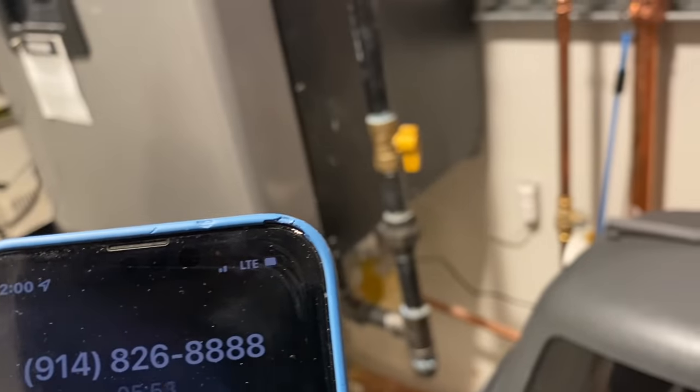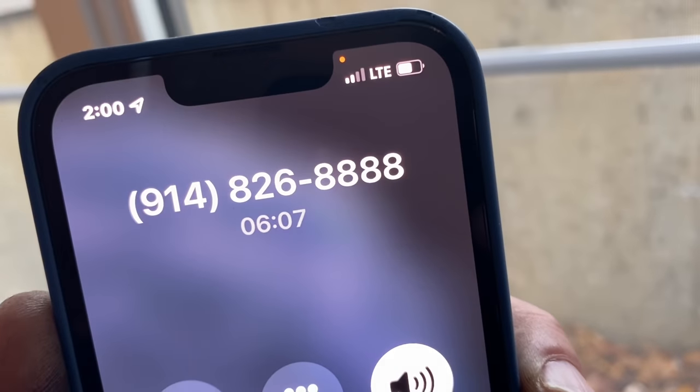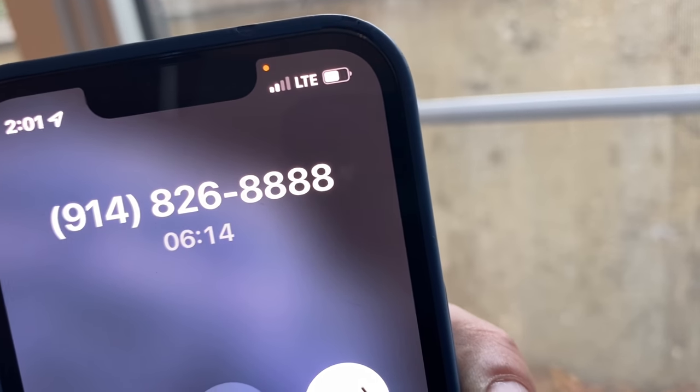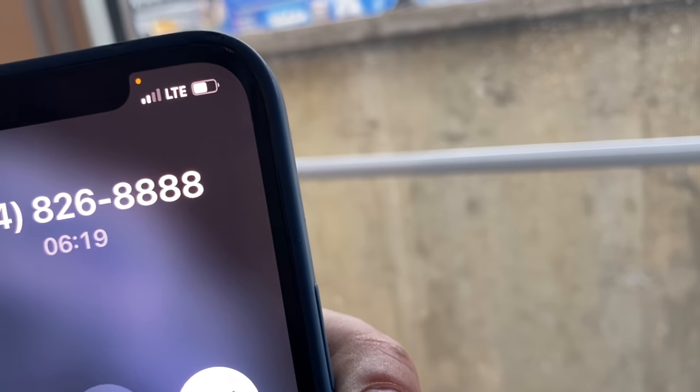9 grains per gallon, so correct. Default is 25. I'm going to bring this down from 25 to 9. Am I correct? Sorry, you broke up. Say again. Oh, sorry, the default is 25. Yeah, it might be 20 grains. In many parts of the United States, the hardness level is between 15 and 30 grains hard. So 20 is kind of an average, but along the eastern seaboard, it's much less.